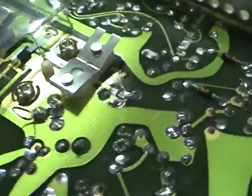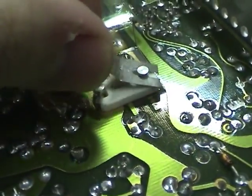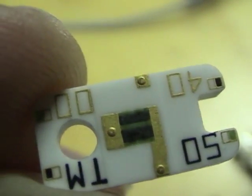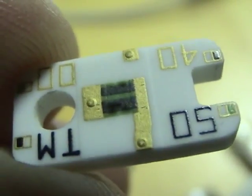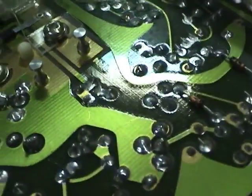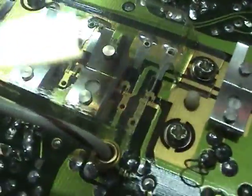I believe the signal from the probe that comes down these wires into this socket, then comes through here. There's these little attenuators, thin film laser trimmed attenuators. Let's see if I can open one of these up and show you. Yeah, these things have tiny little resistors on them. This one's just a termination. They also make attenuators. You can see the little lasers remove part of the resistor to trim the value. This one acts as a termination resistor. Just put that back on. And there's a bunch more of them under here.